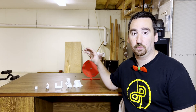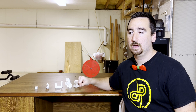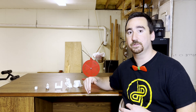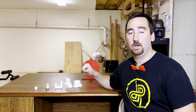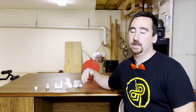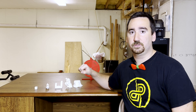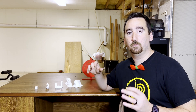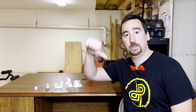Here are my final impressions. For the pros, the filament does look really good when you get a successful print — if you're looking for a nice matte finish, this filament definitely has that. But I did run into a lot more roadblocks than I was expecting. I ran into a bunch of AMS issues, and I've used other PLA filaments on cardboard spools in my AMS and never had problems. The filament was also a little brittle out of the box, causing it to break within the Bowden tube running to the extruder. In the strength test, it did not do as well as other tested PLA, which also shows it's more brittle than other PLAs on the market. I was definitely a little disappointed — I really like Overture's TPU, so I was excited to try the matte PLA. Unfortunately, it's going to be a pass.